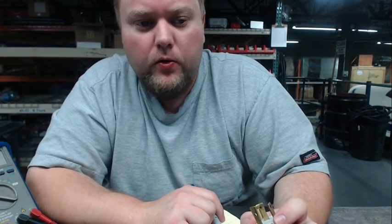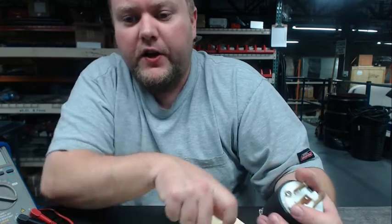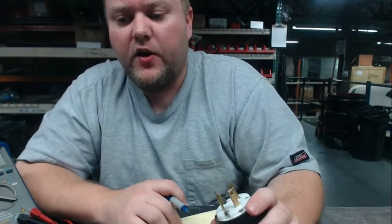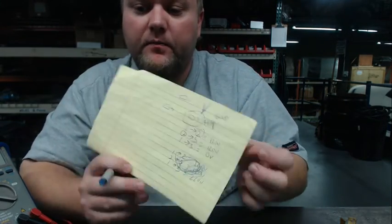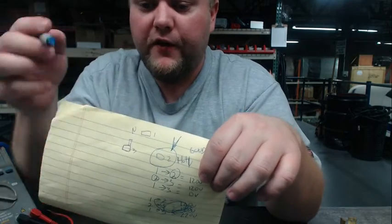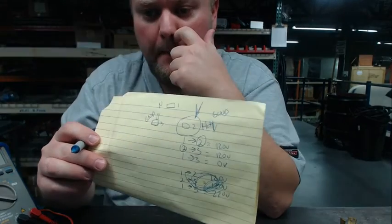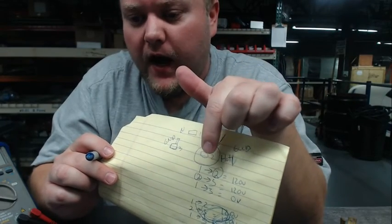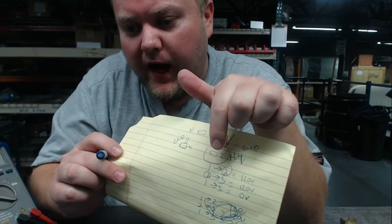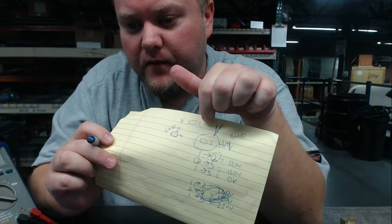Assuming that your simulator end is wired correctly with black to gold, white to silver, and green to ground, that means on the other end where you need to put your new connector, you need to wire your black wire to whatever pin we found is the hot pin. Then wire your white wire to the pin we determine is neutral — for instance if pin 3 has the extra little L on it, we call pin 3 our ground and pin 1 our neutral. But that's less important than the hot wire. Wire your black from the i360 cord to the hot wire on their outlet, green to the ground connection, and white to the neutral connection.